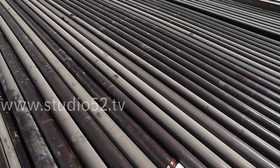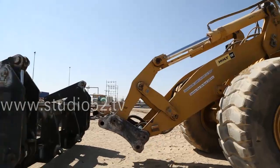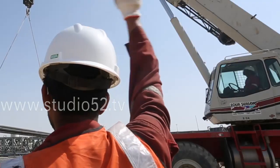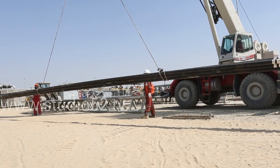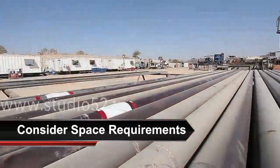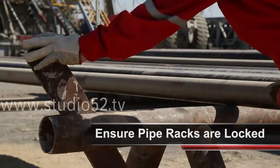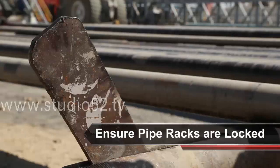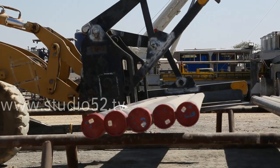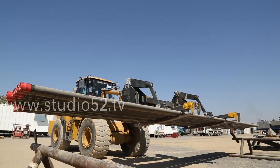In this section of the video, we'll cover the unique requirements associated with handling tubular pipe. While unloading casing, the crane, loader, or forklift must be operated by a competent and fully licensed operator, and a dedicated signalman or spotter must be used. Consider whether reduced or limited space may cause the lift team to be unable to immediately lower the tubular pipe. When loading pipes onto a pipe rack, ensure that they are locked into position to prevent rolling. If there is a possibility that a load may become displaced, use attachments specialized for the purpose of handling such loads.